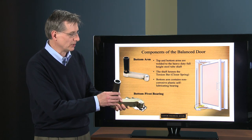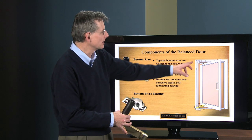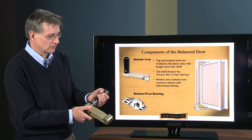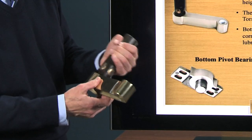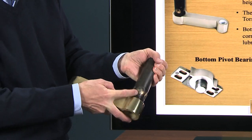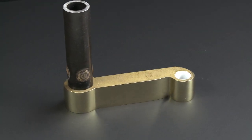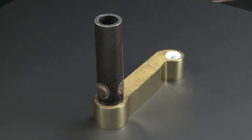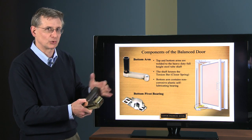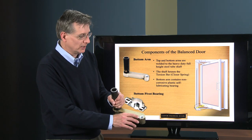The bottom arm has a portion of the shaft assembly that runs the full length from top to bottom, connecting to the top arm. It's welded to the top and bottom arms, and what you want to look for is good true penetration welding. Those little bronze discs are the four welds that hold the shaft to the top and bottom arms, and it's that heavy penetration weld that gives it its strength — you don't want those just wedged in place.